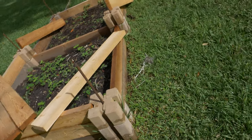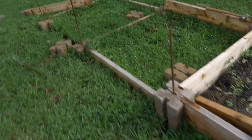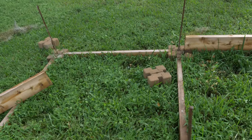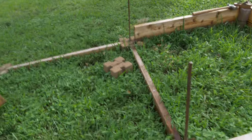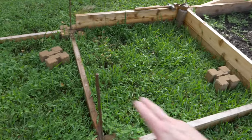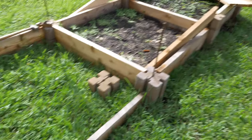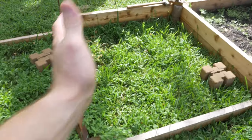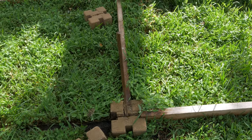It's a hell of a thing. I think I'm just gonna figure out maybe I can cut some scrap bits of wood and screw them in. Really, if I was gonna do this from scratch, I'd just tee the boards together, put them at right angles, and drive some screws through the outside. And if you're gonna make them this long, don't even cut them — I cut them into four-foot sections because of the blocks, but I'd use whole eight-, ten-, or twelve-foot boards and T in some dividers at four or five foot intervals.